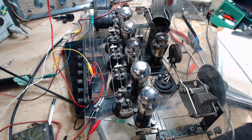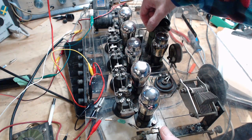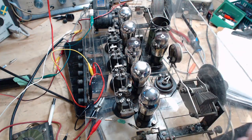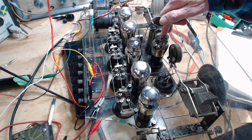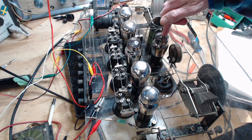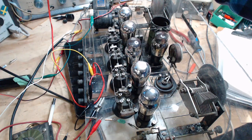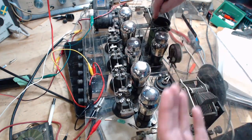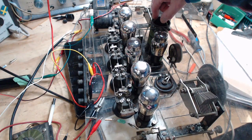So the rotating coil in here is superfluous because the wire from it is just going nowhere. It's just laying here. It leaves the two outer coils, which I think are interacting, grid and plate, for the oscillator. Don't know, just guessing. That's what makes this guy oscillate, if it's still working. The oscillations could be picked up by this coil in the middle. And then they could be presented anywhere on this wire to anywhere in the radio. It's coming right back to the front end, getting ready to go in the grid through this resistor.